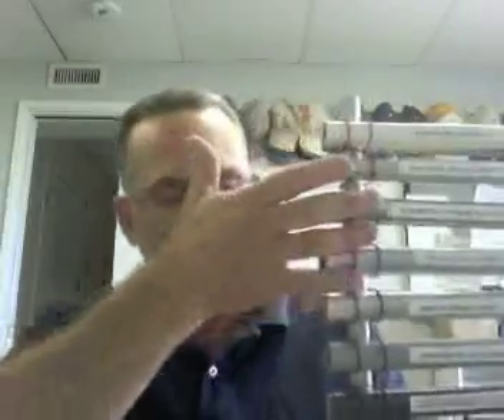This is what you're going to produce, almost exactly as you see it. You have some creativity in the placement — you could alphabetize them, put the flexible ones up here and the rigid ones down there, any way you choose. Use the tie wire, use half-inch EMT for your frame, make sure all conduits are the same size, and cut them straight. The E in CODE stands for effort — I love the way he used a label maker to identify each of the conduits.